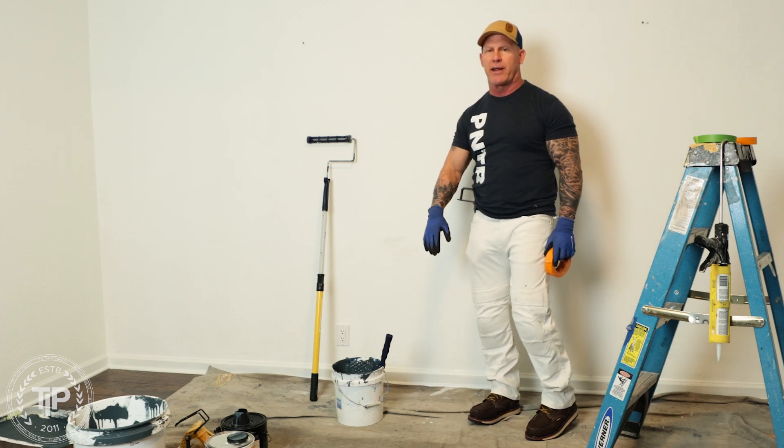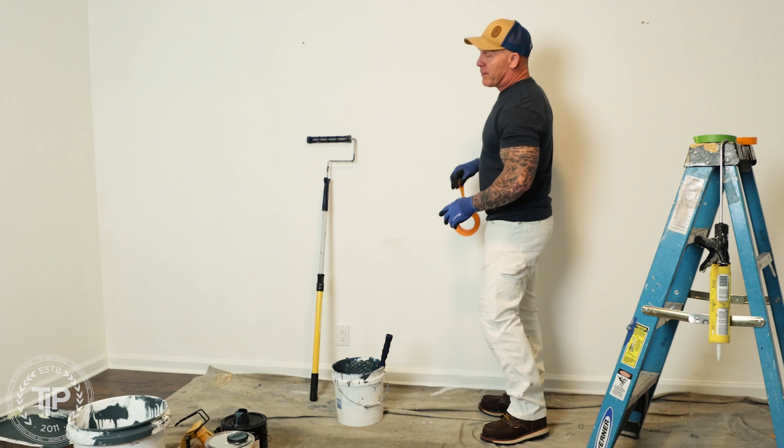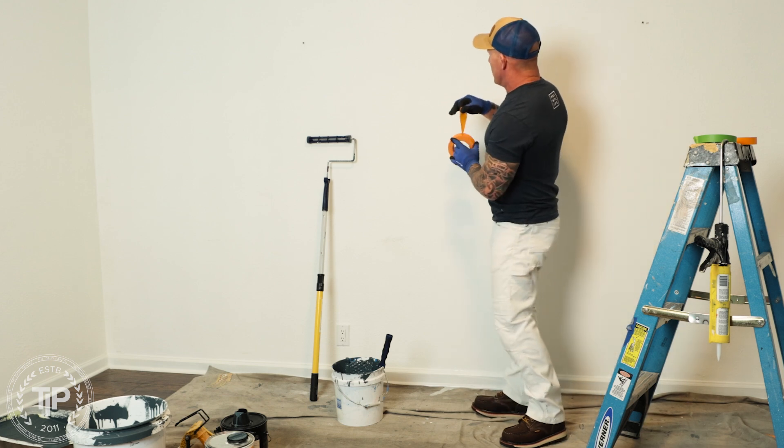White paints and thicker paints are less likely to bleed underneath your tape. But we've got a rough surface right here, and paint more than likely would bleed underneath because your tape has got to form all up and down all these valleys — peaks and valleys — and stick to it, adhere to it. If it doesn't, paint's eventually going to bleed underneath. I'm going to show you on a rough surface how you can actually stop that using just a production tape.